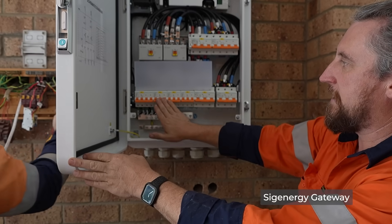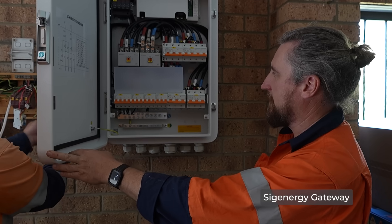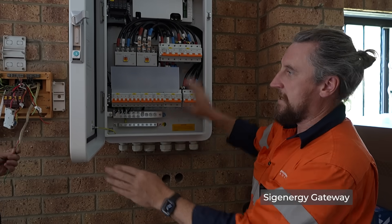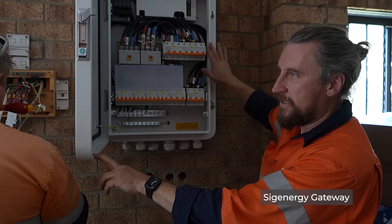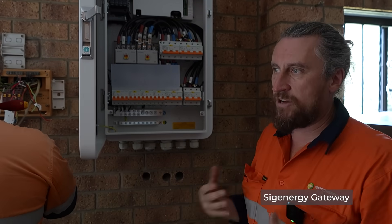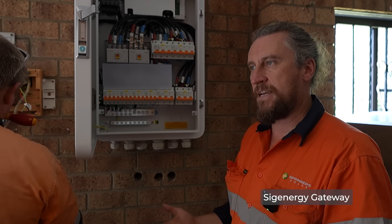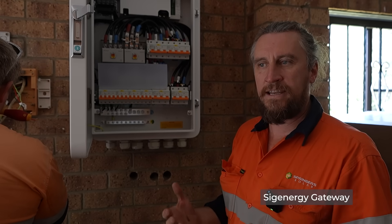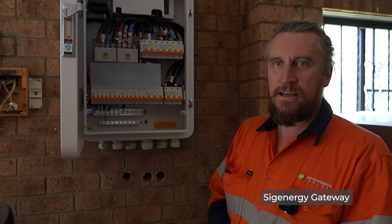Our inverter feed is going to be here. We've got some surge suppressors built into this switchboard just to offer a bit of extra protection for the customer, and we're going to use one of these breakers here for our three-phase EV charger. There's a smart port which the customer is talking about having the opportunity to add a generator input in the future. I'm leaving that open for that input if he requires it — that way he can have a generator run to supplement his batteries. At this stage, I've told him to live with it for a little bit of time because I feel he'll find he's got enough power to get through most days, and it's an easy upgrade as it is.